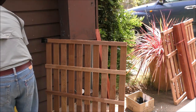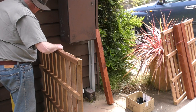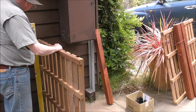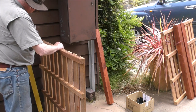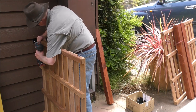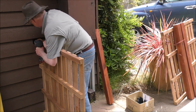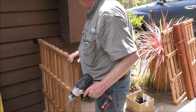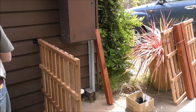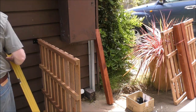So I picked up on one of the inner wall supports. Now that is, I think it's 90 by 45 solid oak. The whole house is made with oak, so it's good and strong, and I know there's no wiring running right at that area. Next to it, that box, that's a sub electrical box, but I know exactly where the wiring runs from there, and it doesn't run past this area, so I'm fairly safe to screw into the oak on the interior of that wall, the support.